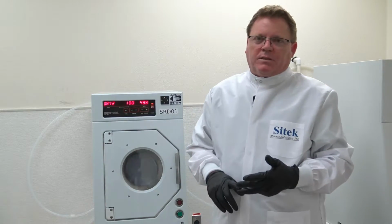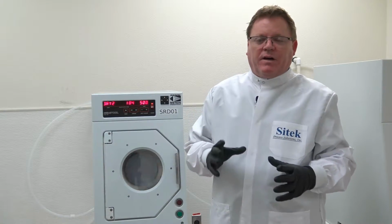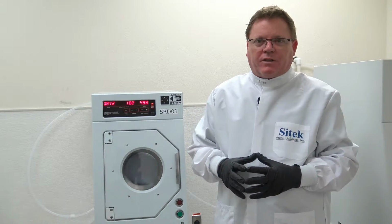It is a state-of-the-art replacement controller that's far and away better than any controller available to any company in the world. It uses diagnostics. It's a smart controller. We have capability of controlling N2 flow. We can track the customer's heaters, their anti-static modules, to give you input if they're working or not. We have full diagnostics. We have multiple recipe capability. There's a total of 20 recipes. And it's off of the current platform of technology.